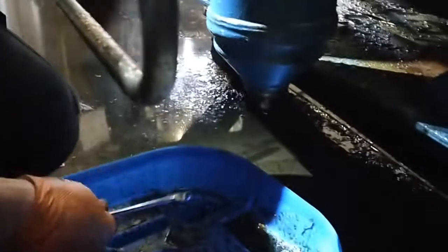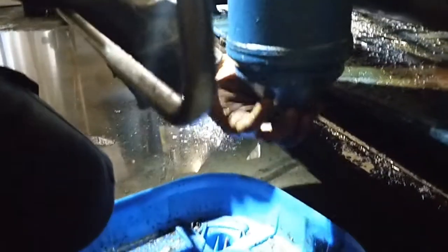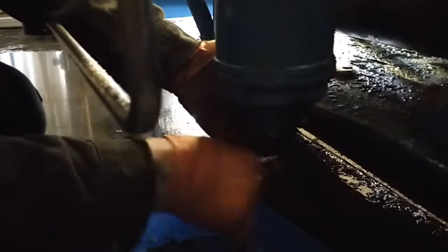Now it's time to install a new oil filter. Place a catch basin under the oil filter housing. Using a 5/8 inch wrench, remove the bolt on the bottom of the housing. This bolt goes all the way through the filter housing to the top of the oil filter — the whole thing will try to fall when you fully remove the bolt.